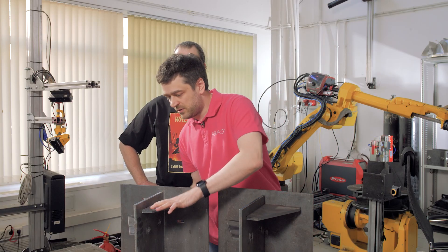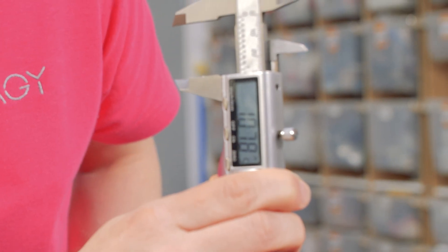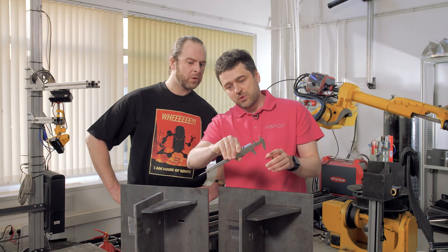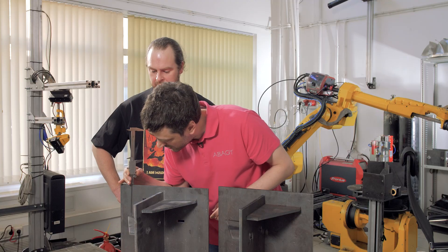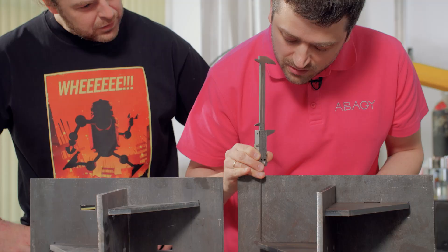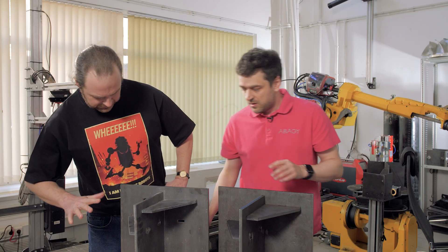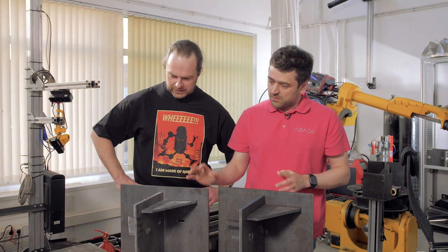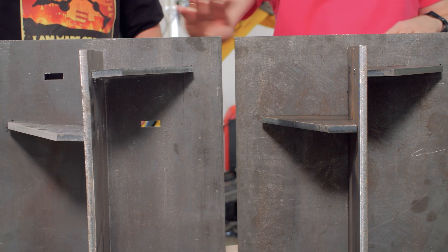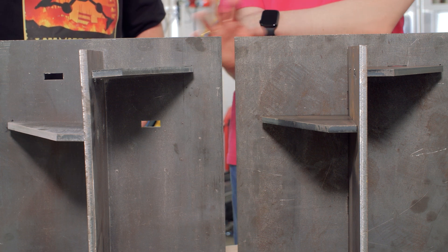This part and this part are inclined a little bit. So if we measure distances here with the calipers — it's one inch here, just over one inch, 1.3 here — more. And 5 inches here, a bit more, and 5.1 here. So this one isn't even. You can't see it with the naked eye, but with your tool. So we can weld it perfectly because of the line scanner. Our system can adapt.